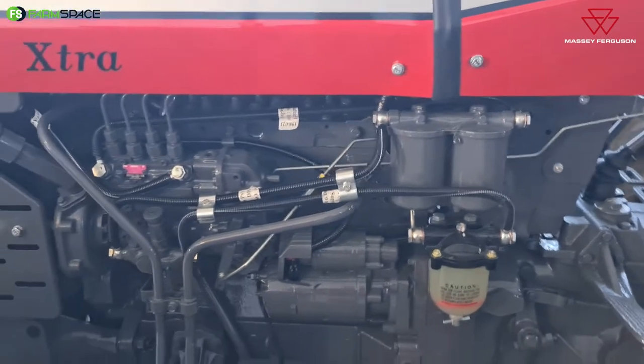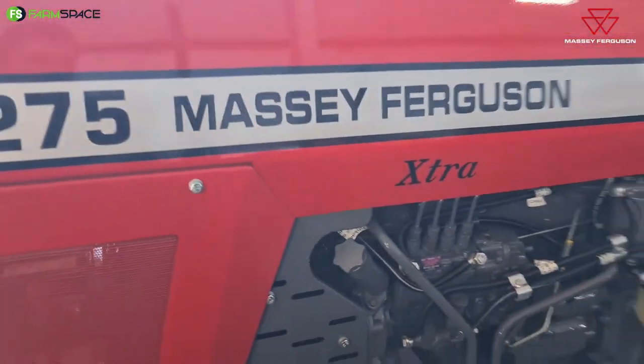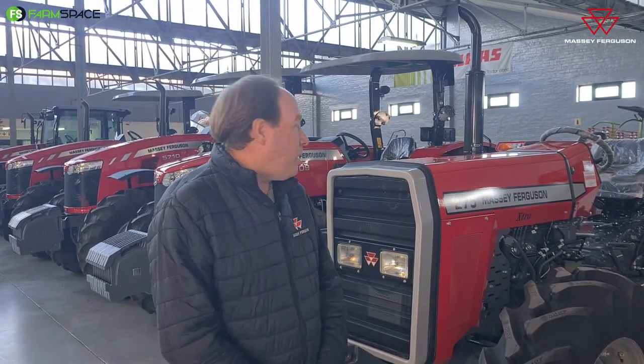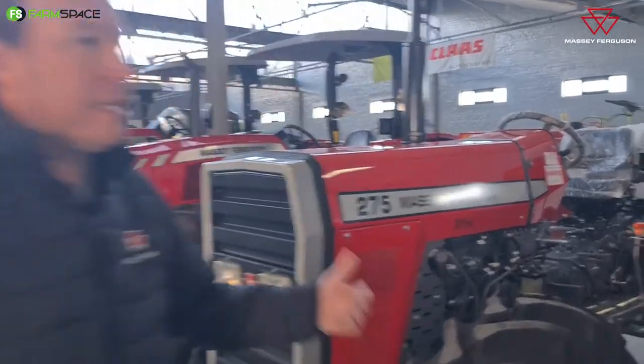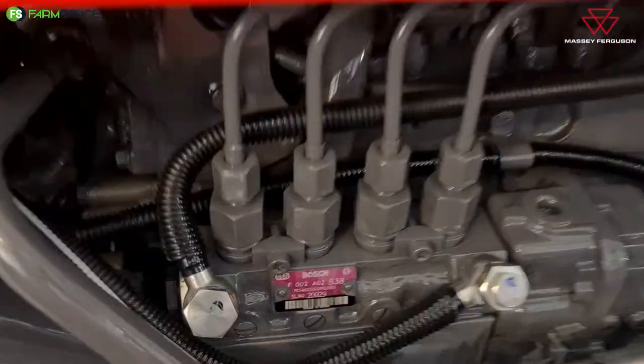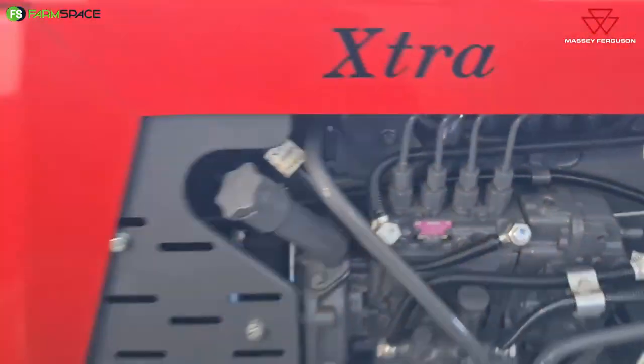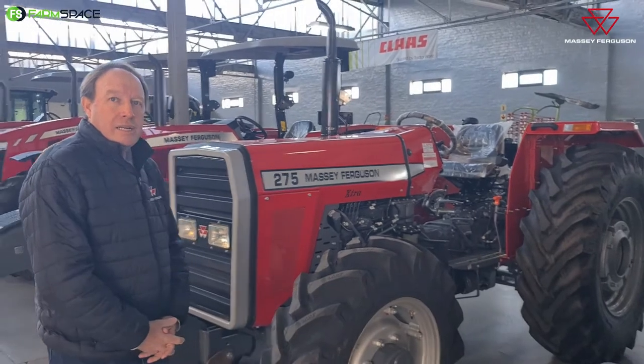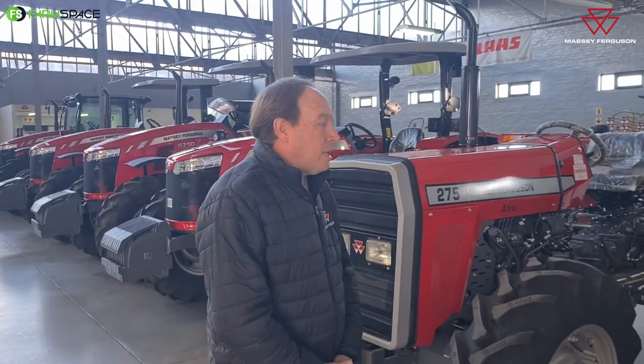Just tell me a little bit more about the Simpson motors — what exactly are they and where are they from? The Simpson motors are from India, made in Chennai. It's pretty much a copy of the old Perkins 152 and 248 motors — very similar concept. They've now got Bosch injector pumps on them, where the later 290s had a Lucas one, but generally now they've got a Bosch injector pump. What most people don't know is that Bosch actually manufactures injector pumps for most companies, which makes it much easier for servicing, getting parts and backup.